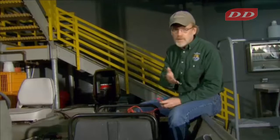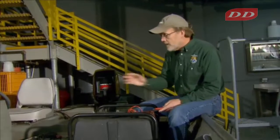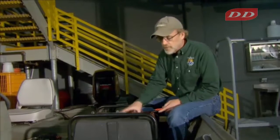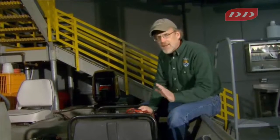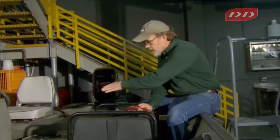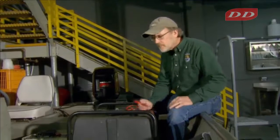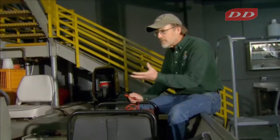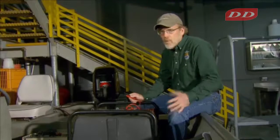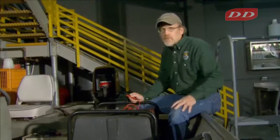The pulsator is also in continuity with the hull, electrically connected to the hull. In this particular system, the pulsator is connected to the hull through the generator. And anything that generates its own charge, the pulsator there, the generator, we want hardwired to the hull. Other pieces of metal that might be in this boat, in particular, the only thing we'll check maybe are the rails, but the major things in a boat are the generator and the pulsator.